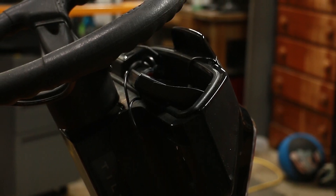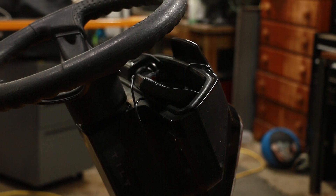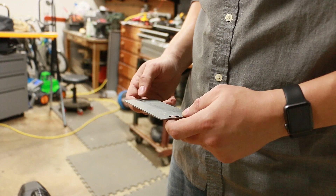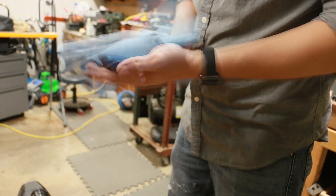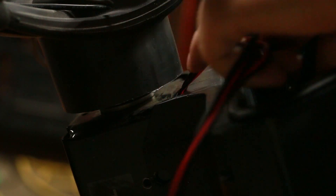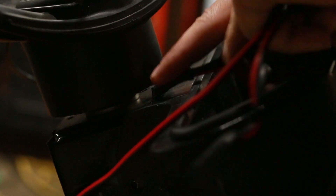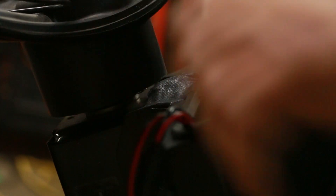There's actually very little exposed wire for all that. I still need some way to extend the reach of the monitor, so I'm going to try an electrical gang box cover — pretty easy to find. I could spray paint this black, but I wonder if I can just cover it with gaffer's tape and get away with that. Looks pretty decent. I don't see any way around having this severe bend on these wires, so I'm going to wrap them in gaffer's tape to protect them, and I'll wrap this clamp connector with some electrical tape because of the exposed wire parts.